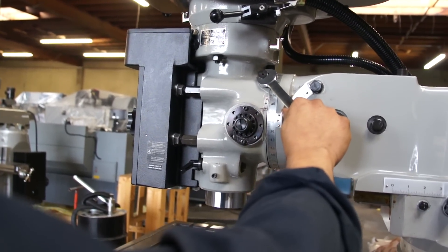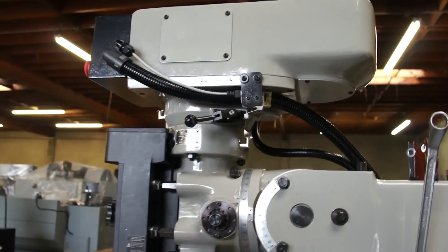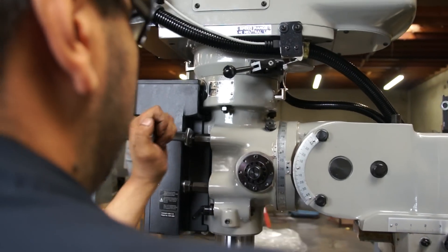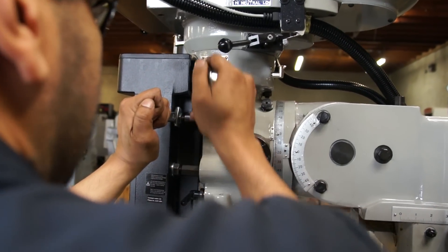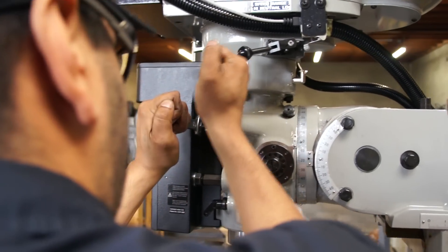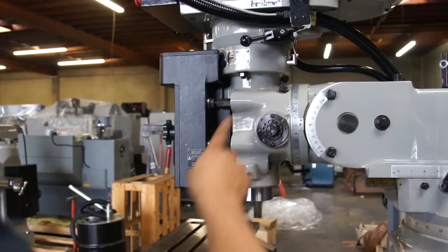While we're tilting the head, we need to have somebody supporting it to relieve the strain on the bolt. After reaching the desired angle, we tighten up the coupler nuts, holding the jam nut in place again — tighten on all four points. At this point, we're done.